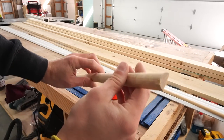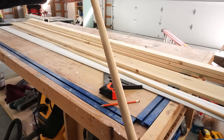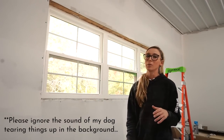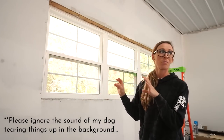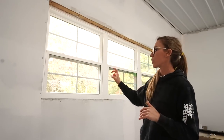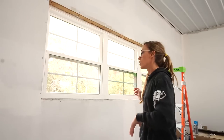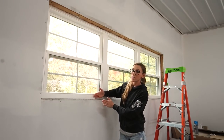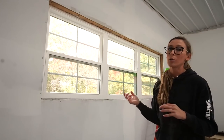Now a quick note about your wall thickness. The way that I trim out windows, I like to have a little bit of a ledge that sticks out — mostly because I like to put plants in my windows. So it's important to see whether you're working with 2x4 walls or 2x6 walls. This is a 2x4 wall so I can fit a 1x6 here for my window ledge. If you're working with a 2x6 wall, you might want to opt for a 1x8 instead.